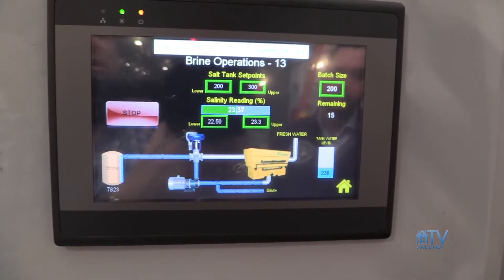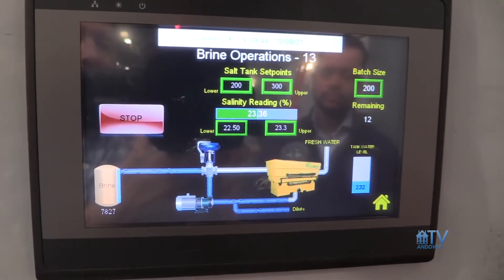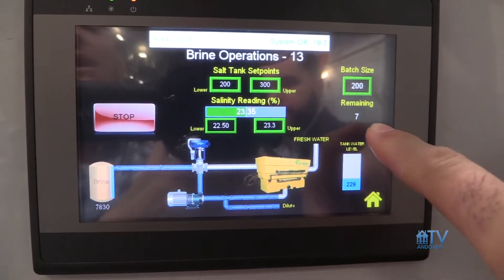There are certainly a lot of different compounds you can add to make salt brine more effective at different temperatures. One of them is any sort of carbohydrate that has sugars in it, like molasses and other components. What it essentially does is lower the working temperature of the salt brine so it can be more effective at lower temperatures. On top of that, those carbohydrates, when they dry out, provide the stickiness that allows the salt brine to bond better to the roadways, and not to the tires or anything else on the vehicles.